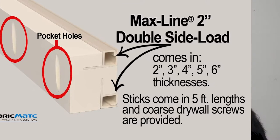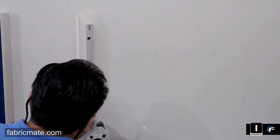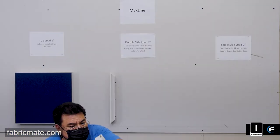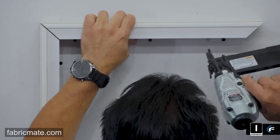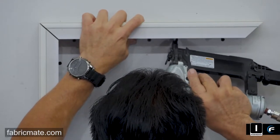So you're going to see a little demonstration here in front of you. What we're doing right here is called soft tacking. This is a pin nail gun — you might be able to use a staple gun as well, but this is a regular finish nailer. This just allows you to soft set the product onto the drywall, making it a little easier to go ahead and set the pocket hole screws. It's not necessary; we've just found it to be a little bit more helpful.